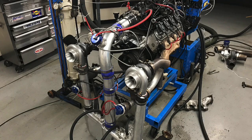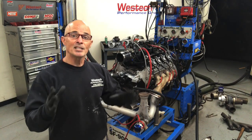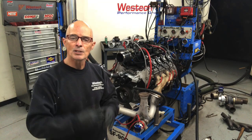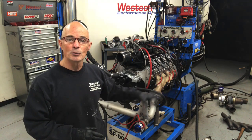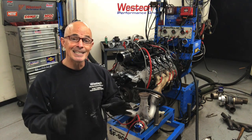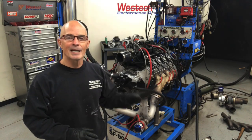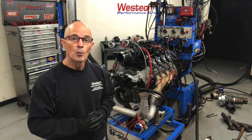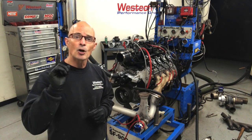What does it take to build a do-it-yourself twin turbo kit for an LS? Let's find out. In this video I'm going to show you what it took to build a custom twin turbo setup for an LS. This happened basically out of necessity - we have our single turbo setup that we normally run on LS motors. I used the stock truck exhaust manifolds and made a custom Y-pipe. Now we've run twin turbos before but I use the DNA stainless turbo manifolds and I don't really like them. They burn plug wires and the plug access is no good. So I really like the stock truck manifolds, and now I need to do a custom twin turbo setup with the stock manifold. Let's get going.